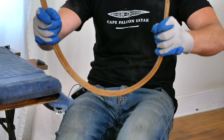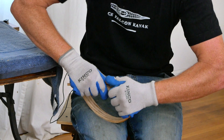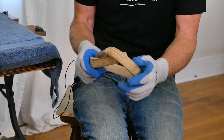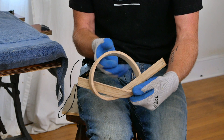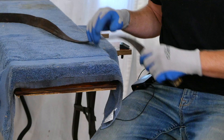Now let's do some failure testing — once again southern white oak, we're going to try to tie this into a knot. I'm having a hard time tying this into a knot, and part of that might just be the stiffness of the wood. I'm not being very successful with the southern white oak here, but it's still making these bends fairly well — it's just a lot harder to get them tied into the actual physical knot. This is very consistent with my previous experience with southern white oak vs. Oregon white oak. I've also got a little bit of split out here — a little bit more than on the Oregon white oak — but overall fairly similar.